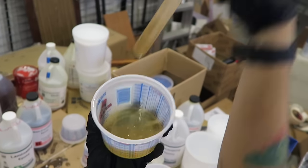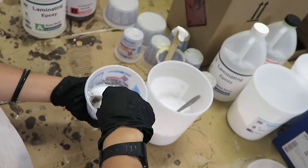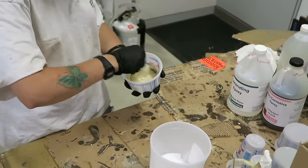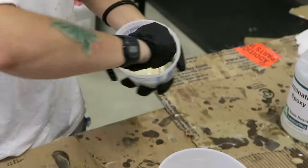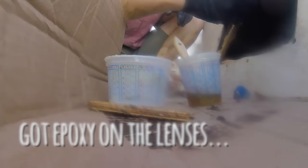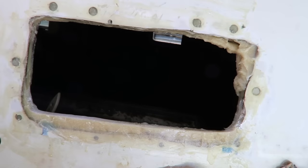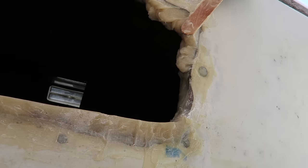The mixture will have a honey-like consistency, but if you need a thicker solution, add the silica powder to it and watch as it gets denser. Depending on how much you add, you can make it into Play-Doh. We used the liquid epoxy to paint the insides of the portholes and the plywood. Then we put globs of thickened epoxy on the plywood pieces and stuck them in there. In parts where we knew the frame was cut wrong, we compensated with globs of thickened epoxy so that the portholes would fit better afterwards.